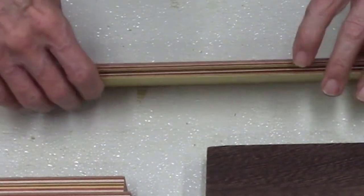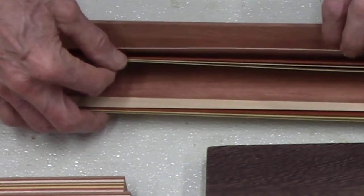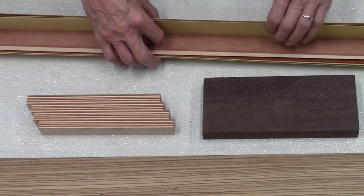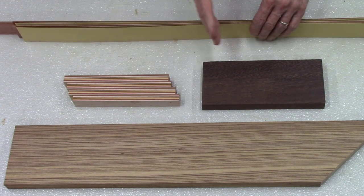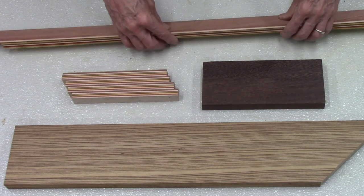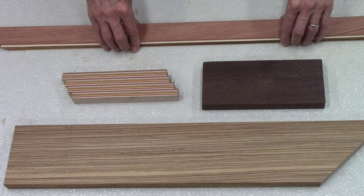And this is a brand new piece I just put together. It has two pieces of bubinga about 360 thousandths of an inch thick, and then I have some very fine layers of maple, padauk, yellow heart, and katalox next to that, repeating that same pattern. I will glue this up, cut it into four sections, and glue it up much like the previous one to create a wider strip, then make my inlay sections for the herringbone pattern. So that gives me four different patterns for the center portions of these herringbone and rope design projects.